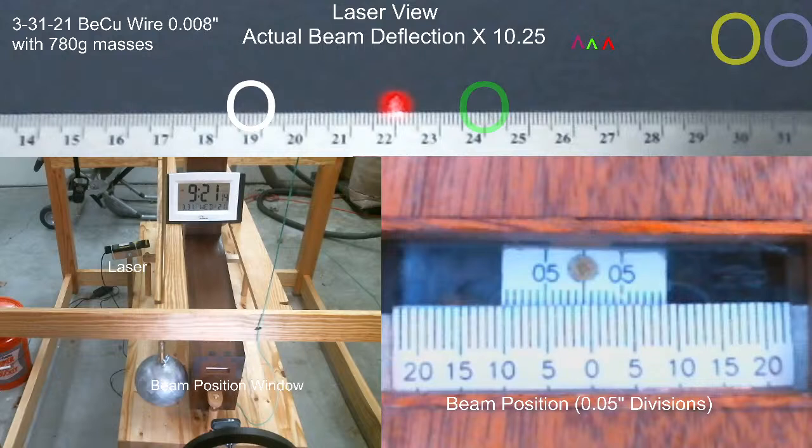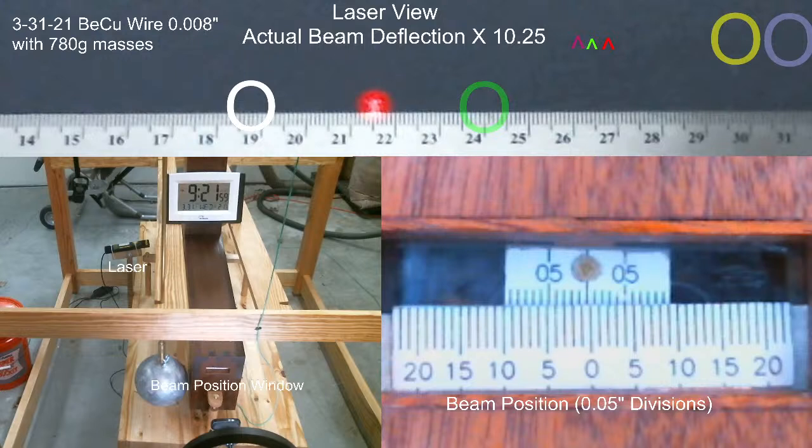Well, what's that telling you? Obviously, there's some surface charge being built up on the wood. I finished this thing with tung oil, and I think over time the tung oil finish dried out and the surface resistance became pretty high. And inadvertently, I don't have it sitting on wooden posts in the ground. I've got it sitting on a wooden table with leveling feet that have felt pads on the bottom. Not even thinking about it, I made a really perfect insulation system, and that wooden cabinet was actually developing a surface charge.